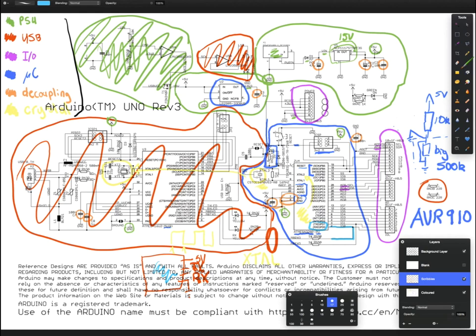Here, when we look at this circuit, it actually connects to the TXD. And that's because when this guy is receiving, this guy has to be transmitting. So we need to actually swap which pins connect to each other. And so to do that, we just swap the order of pins. This is really, really important, and almost certainly a lot of people are going to make this mistake. But it's very simple. You just swap the pins.